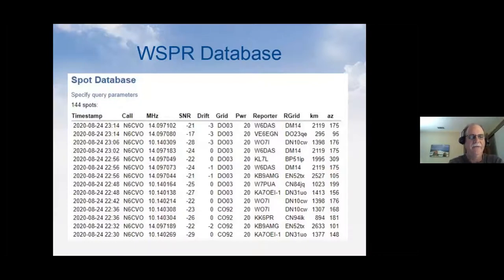When I said before that these transmitters are frequency agile, well, some of them are actually capable of transmitting on different frequencies within the WSPR subband. So you have a 20 meter band, the WSPR subband is only 200 hertz wide, but you only need less than 2 hertz to transmit the WSPR on. So what the transmitter does is it randomly picks different frequencies within that 200 hertz subband. And that allows you to move around in case there's some big gun station camped on a frequency and wiping you out. You have more likelihood of getting through.